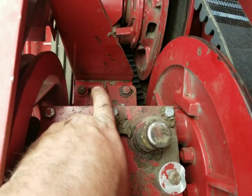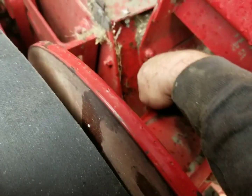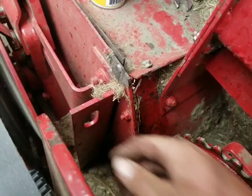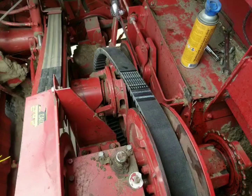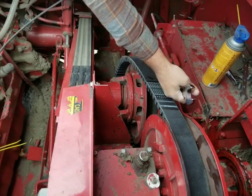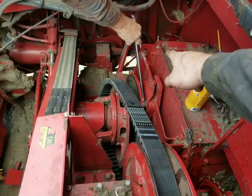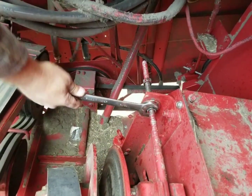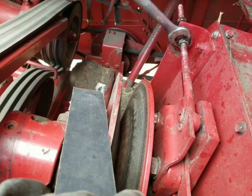Okay, so I actually didn't have to loosen them bolts up and turn this gearbox. I was able to get the belt up and around here and got it between the adjuster and there. And with a little penetrating oil on that wall, I was able to turn it and it slid the belt right around and got it up where we needed it. Now we're trying to loosen the rotor up so that we can move the rotor towards us and get the belt threaded on that pulley. All you've got to do is loosen them bolts up, then loosen them nuts up, pry it over, and then it should slip right in that pulley. By tightening that nut, you're pushing the rotor over and it will loosen it up so you can get this belt rolled around that pulley.